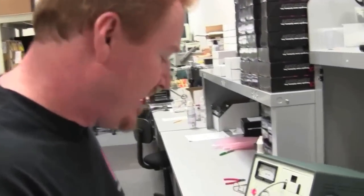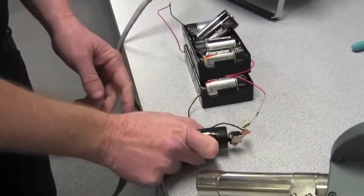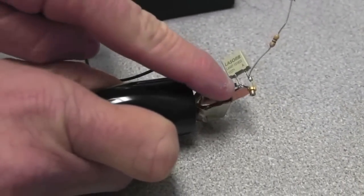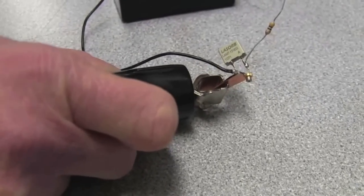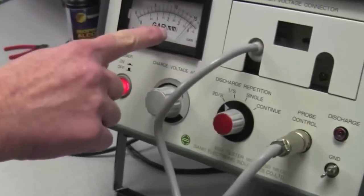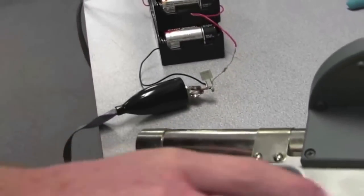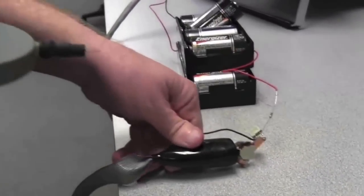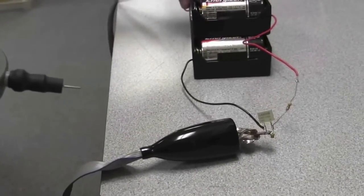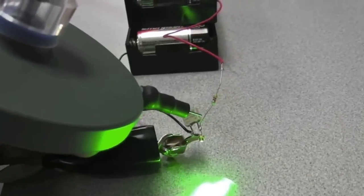Next I'm going to show you exactly how sensitive these things are to ESD and how they can be protected by Laser Orb. What I've got here is Laser Orb connected up to this green laser diode. The green laser diode is mounted on a piece of copper so I can get a little bit of longevity out of it and it will act as a heat sink. We have our ESD gun set for 15,000 volts and 20 shots a second. We're going to let the sparks fly. I've got a battery power supply here supplying it with some power — go ahead and turn that on. See the beautiful green color, 15,000 volts, 20 shots a second.